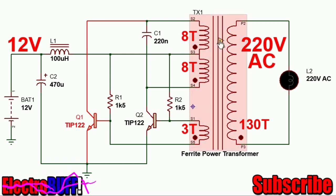After some time, the core saturates, and since current cannot increase any further, it will cause the induced voltage to start collapsing. The polarities at the auxiliary winding reverse, giving a negative potential at Q1's base and a positive potential at the base of Q2. This causes Q1 to turn off very fast and Q2 to begin conducting, allowing current to flow the other way round — from the power source through the inductor through winding S3 and S4, through transistor Q2, and to ground. Current continues ramping up in winding S3/S4, and after some time the core saturates again and the magnetic field begins collapsing, causing the voltage on the auxiliary winding to reverse again, turning Q1 on once more. This process repeats many times per second.